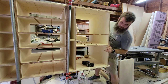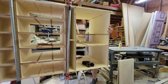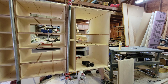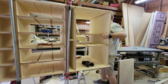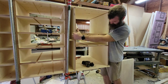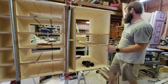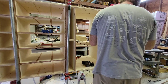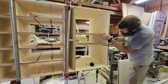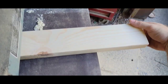When you're working with so many different dados and pieces of wood, sometimes you run into this — it's not a huge deal because they were pretty close. I'm squeezing the panel just to get the dados lined up, and then I get everything down nice and flush, clamp it all, and let the glue dry. Now the glue's dry, we've got the very bottom divider — that one has two more dividers within it. It went in really well. It was about 60 dados per cabinet, which was a lot — a lot of room to go wrong — but it lined up really good, so I was happy.